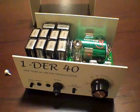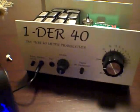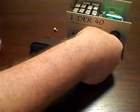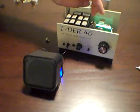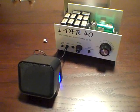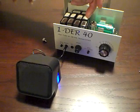There is some microphonics that occurs with this rig, but I think that just adds to the charm. I'll demonstrate that now — I'll just plug it in. What I'm using here is an amplified speaker, and I'm going to turn it on. You can hear it through the speaker. I'm just going to tap the unit. I think that adds to the charm. So if you're in a high vibration area you certainly wouldn't want to use this rig, but sitting out in the field on a table, this shouldn't be a problem. It almost sounds like a gong.